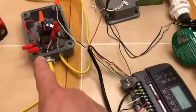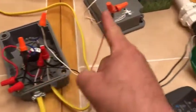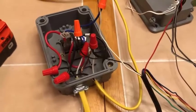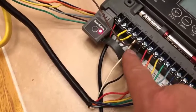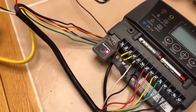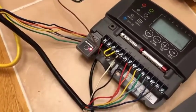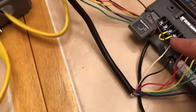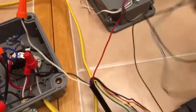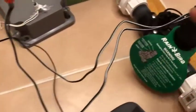I stole the brown for a secondary reason: because I have my power over here and my valve over there, I didn't want to piggyback from my white wire all the way over — which you could theoretically do — I just wanted the shortest differential, assuming these are 10, 15, or 20 feet apart. So instead I used the brown wire and put that in at the same time on the common. That's commonly done in electronics where you're hooking two wires to the same breaker, like daisy-chaining electrical outlets. The brown wire, representative of the white going to the solenoid, comes up connected to one, and my red which is zone one is connected to the other wire going over to the solenoid.